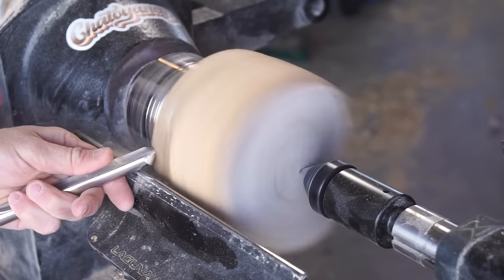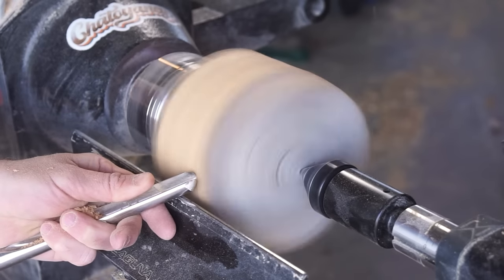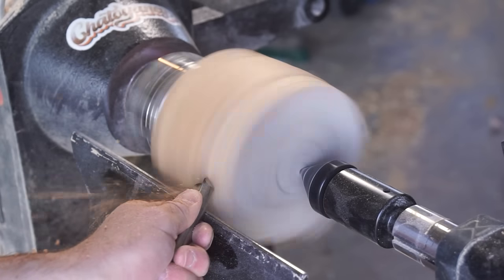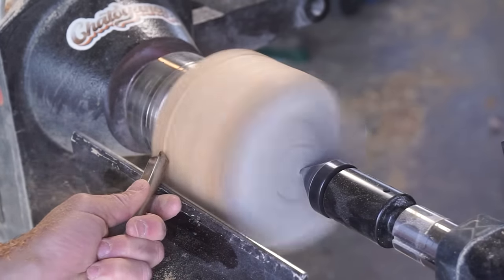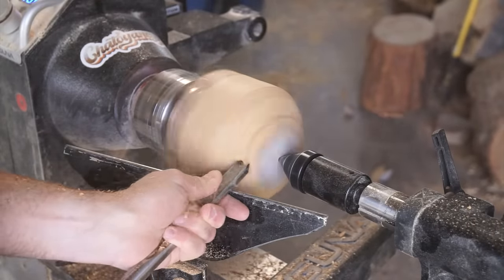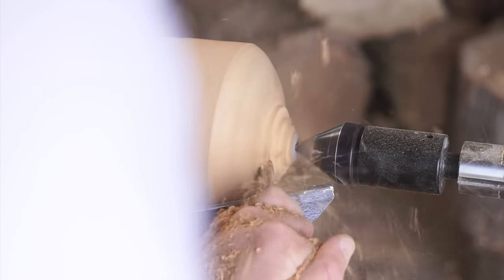It's hard to say exactly how old this fence post is — I'd say at least 50 years, but it could honestly be closer to 100. The main thing I want to be careful about with a piece of juniper wood this old is cracks or fissures that run the entire way through the log. Juniper wood is notorious for splitting easily, and the last thing I want is for half of this to fracture and fly off the lathe. I've had it happen before and it's decidedly not fun. I did some stress testing with this piece and felt pretty confident about it, but when you're working with a piece of wood that's been chilling out in a field for decades, it's always best to be a little extra cautious.